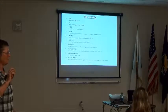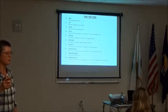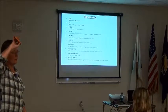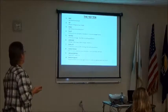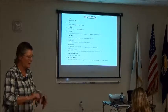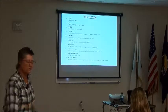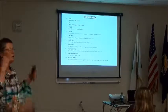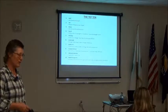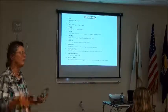Rule six: check quality. If you use crappy materials you'll get crappy results. You've got to pick and choose what's worth spending on — a good tester is $110 and worth every penny. Rule seven: consistency. Don't sometimes put insulators one way and another time another way, don't vary your post spacing from 10 to 50 feet randomly. Do the same thing every time — consistency means efficiency.